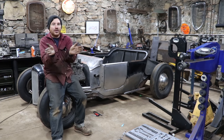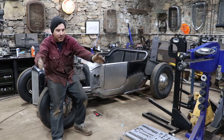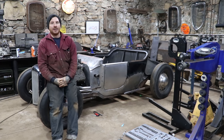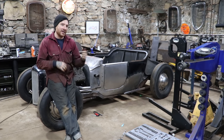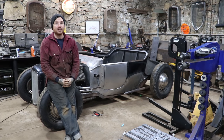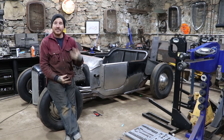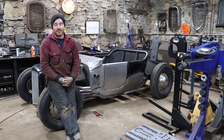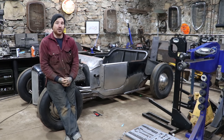So it went around the water necks on the heads, and then it dropped down and went in, and it was a lot of trial and error, a lot of bending stuff over my knee. No real fancy tools for that. It's just finding some tubing to bend around that had the right radius, using my knee, my hip, whatever, to adjust it, tweak it, tap the ends, cut the thing down, tap the ends, and it all fits pretty good. I think it flows pretty well.